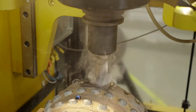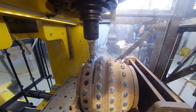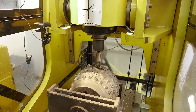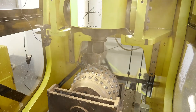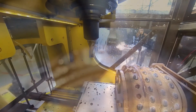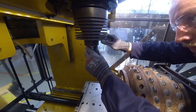This removes the irregular damaged area and ensures a repeatable process geometry. The aim of this process is to develop a procedure for friction hydropillar processing to be used to repair damaged locations and allow the fitment of new tungsten carbide buttons. A purpose-developed consumable tool is inserted into the tool holder.